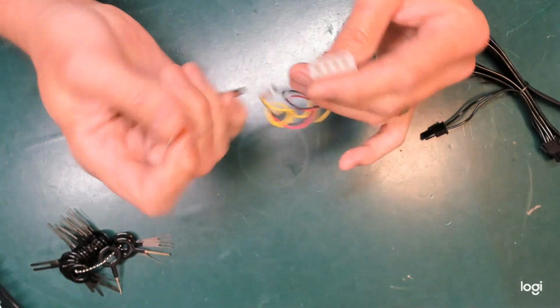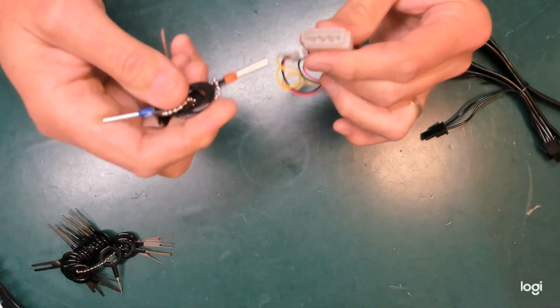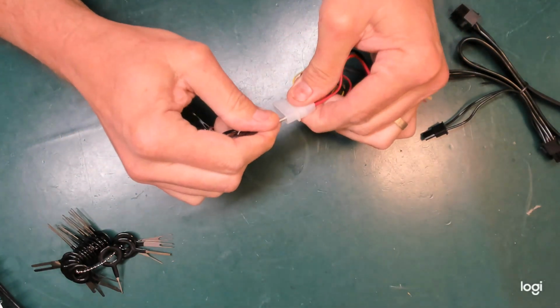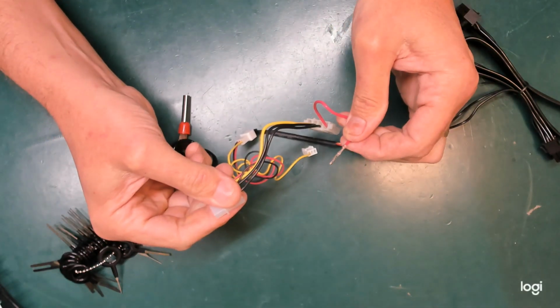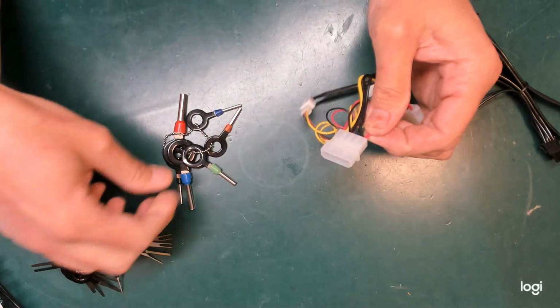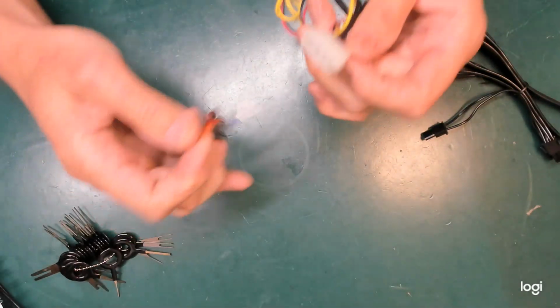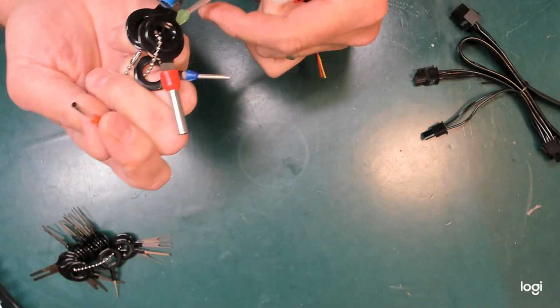These ones that are round are a lot easier, and we use these tubes for those. These tubes go on like the socket would, but pass up into the connector and fold the little tabs down. Of course it needs to be the snuggest fit, so just push that right onto the red one here on the end and just pull it out. That's all there is to it. Back in, snug. And as the lock-picking lawyer would say, one more time to show that that wasn't a fluke.